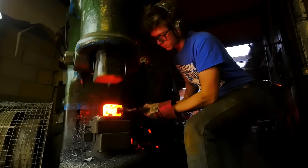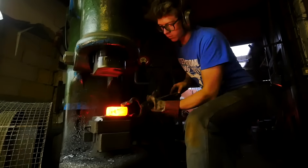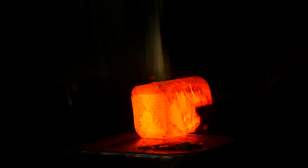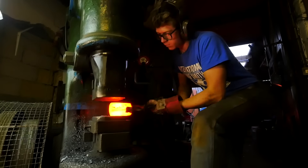This means that I have a greatly reduced amount of surface area contact, so I'm going to move a lot more steel with the added pressure. I go all four sides and bring it down and get it to the square shape, cleaning up any rhombuses that develop as I go.